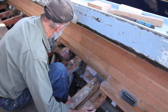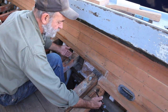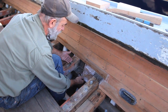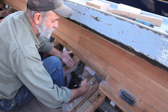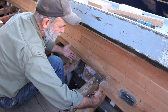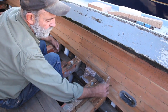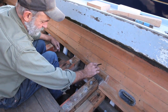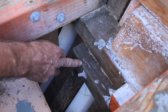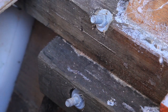This is where the two clamps — the upper section of deck and the lower section of deck — kind of come together. What I've done is extended the after one forward underneath the forward one and bolted them together, because I don't want to create a hinge in the boat or any kind of weakness in this area. We're trying to stiffen the area up, and it's got three very strong plastic frames running right through the area.